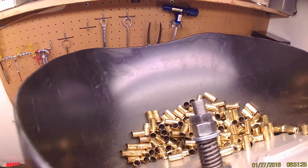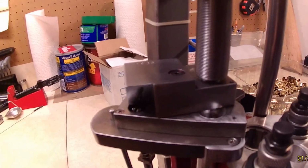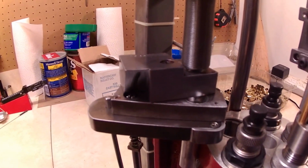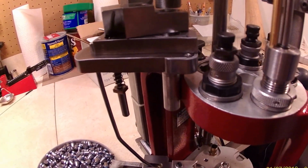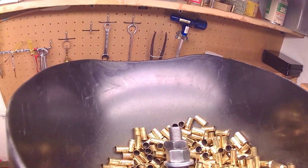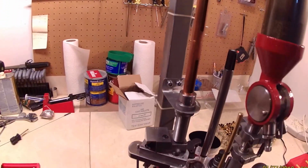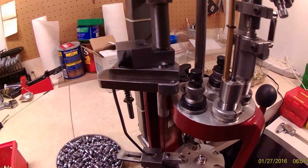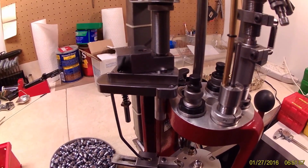The feeder itself, you'll need to put a clutch in it. The motor, if it jams on a case, doesn't like it, you'll strip the gears out. You've got to put a clutch. There's a friction disc with the spring pushing a metal disc against the friction disc. That's what will do it primarily. It'll allow it to slip.